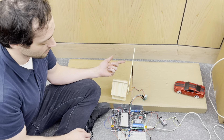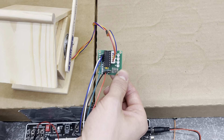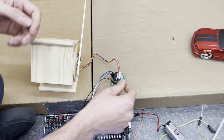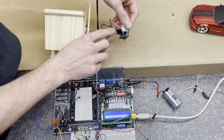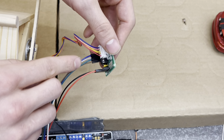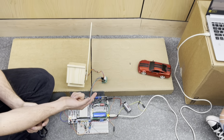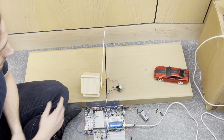This piece here is a driver for the stepper motor — it comes attached to the motor. What it does is allow the stepper motor to turn: when you write these four pins high in a certain order, the motor turns in one direction, but to get the motor to turn in the other direction, you write them in the same order but backwards.